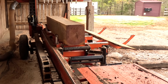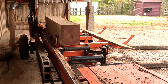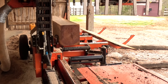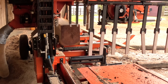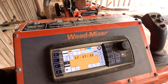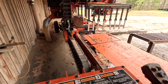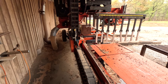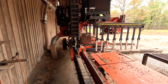When using a chain turner like this one, you've got to be really careful not to scratch the faces of the boards. Or if you are going to scratch them, scratch them where the sapwood is because that's coming off anyway. I'm going to start a little high, go down to pattern mode. That's even with the face — this is the next cut. That's the beauty of a good computerized set works: it allows you to do this kind of stuff without losing your place.